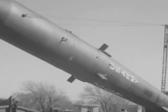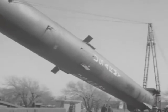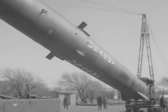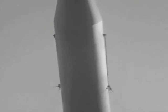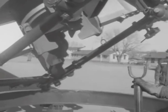The missile is now being raised to its vertical firing position by the erector servicer lightweight H-frame and A-frame equipment. A 10-ton capacity winch located on the bed of the 2.5-ton erector servicer truck pulls a cable attached to the top of the A-frame. The rotating A-frame in turn pulls the missile to the vertical position with the use of 2 cables attached from the top of the A-frame to the sides of the missile. Note the carbon jet vanes used for steering at liftoff.